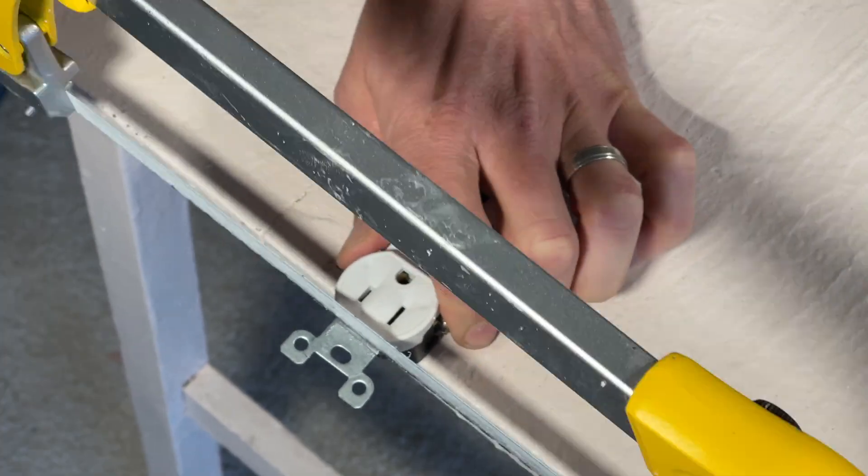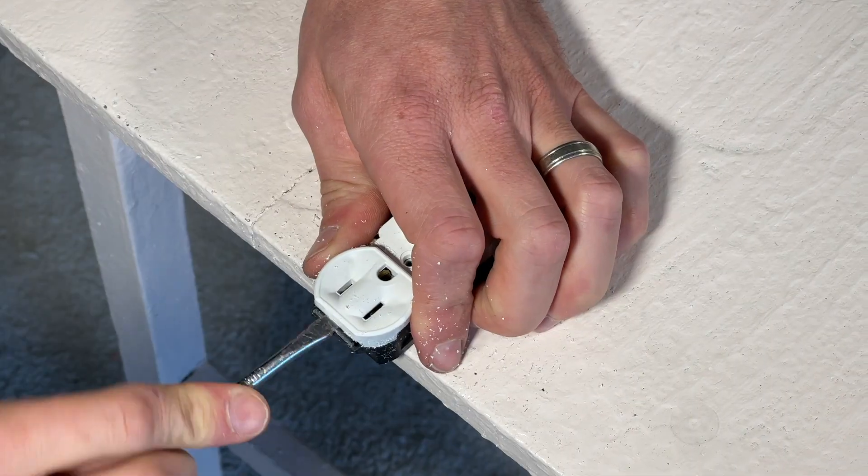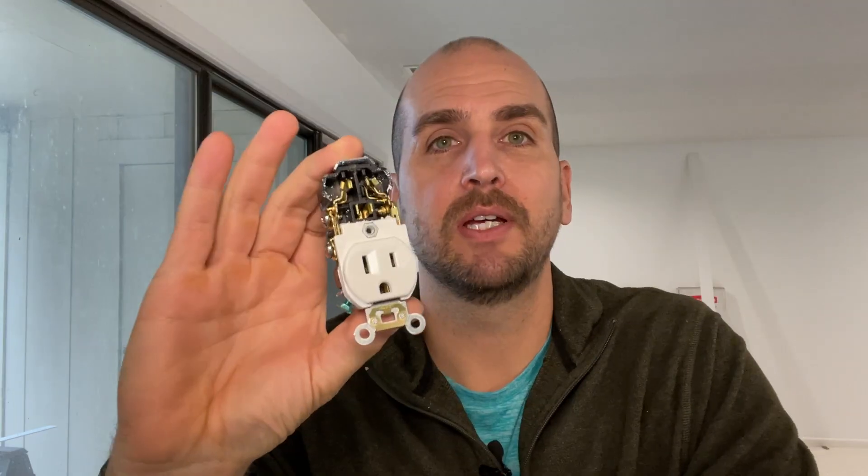You have alternatives, and those alternatives are going up to commercial grade. So I busted out my hacksaw and I cut into that outlet. Once I cut in, I just wanted to see the internals and what that looked like. I did the same thing for a commercial grade outlet. Here's the commercial grade, and I really wanted to see: what am I getting for the difference between the 50-cent outlet and the $2 outlet — the guts of it, the things that are actually going to hold up better over time or fail. Let's jump in and take a closer look, and I'll let you know in the end: am I upgrading? Is there a big enough difference that I'm going to be spending the $1.50 additional per outlet?